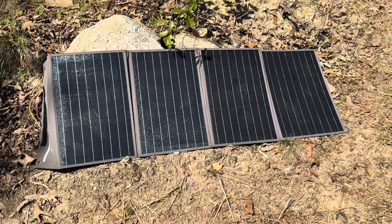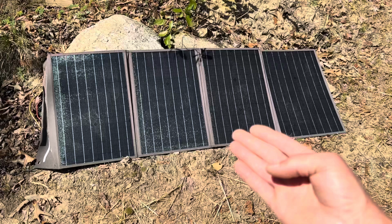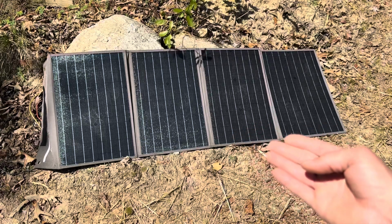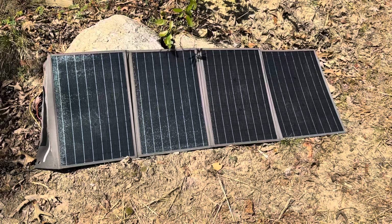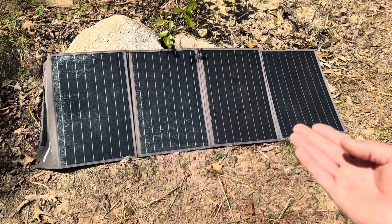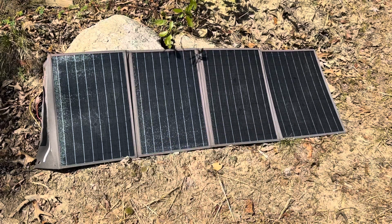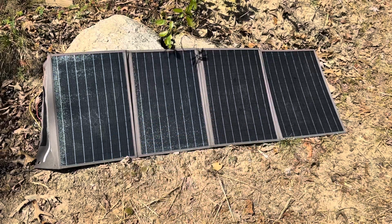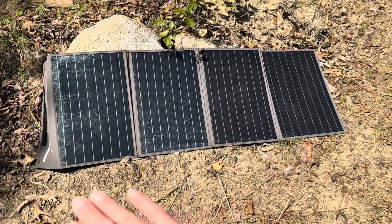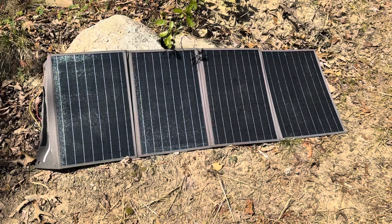I hope today's video is kind of short, but I just wanted to show you, don't knock the folding panels. A lot of people knock these panels and say you can't leave them out. A lot of the manufacturers recommend not to leave them out. So always follow your manufacturer's recommendations, but these have been out for over a year. They're faded, the fabric is, but the controller still works. The glass still puts out full power compared to a monocrystalline, and it is neck and neck with a regular glass monocrystalline.